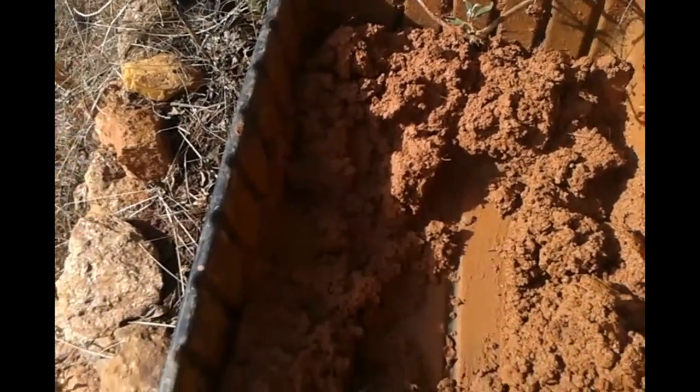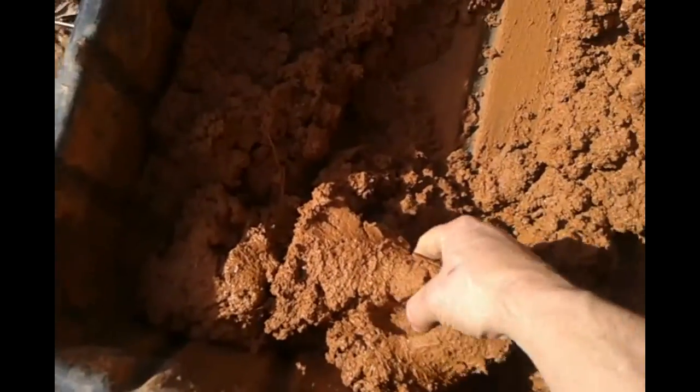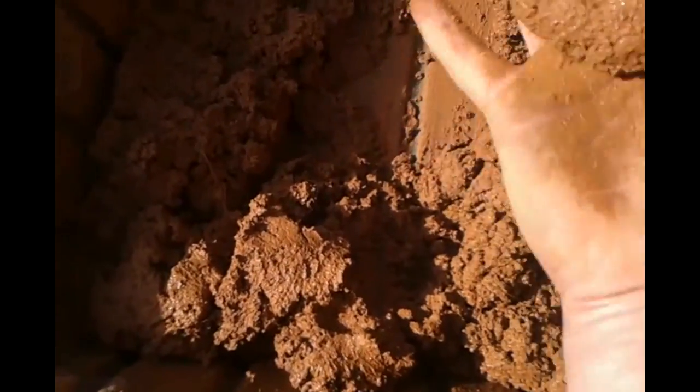I got that mixed up pretty well. It's got kind of a nice, sticky, peanut buttery consistency. Let me show you a little bit up here. The first thing we want to do is evaluate our surfaces. You see all those surfaces? I put nails in them to hold up the rocks. Got a nice flat surface, except for this little dip right here, so I'm going to fill that in some.